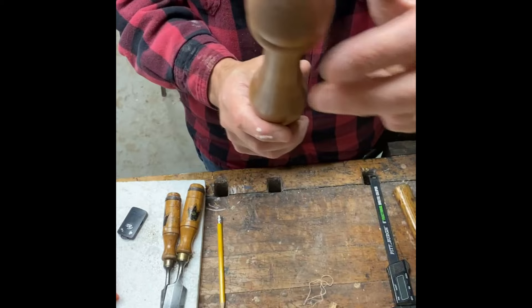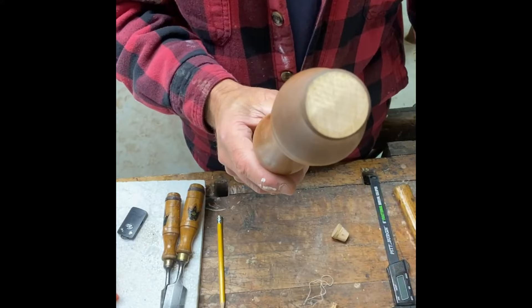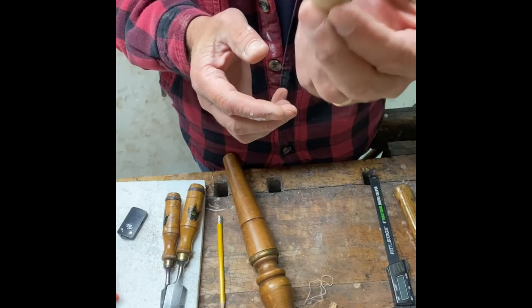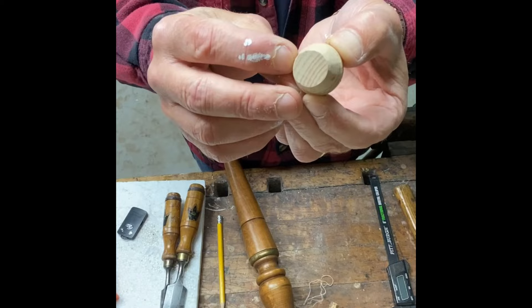What we've done is cut off the broken portion of the dowel, giving us a nice flat surface to work from. I cut it with the handsaw, then ran it over to the sander to get a nice flat surface. The work we did at the disc sander turned that one-inch dowel down to 11/16" at the ends and 13/16" at the outside edge.